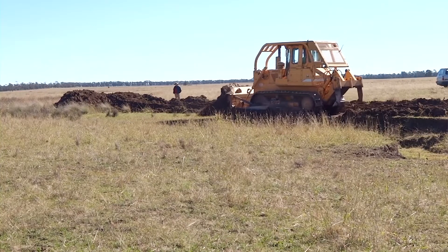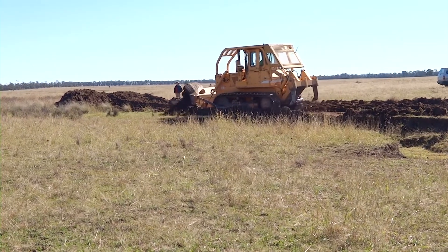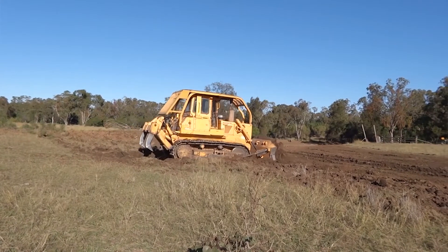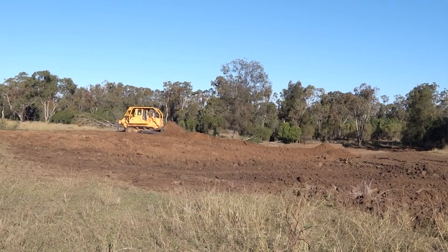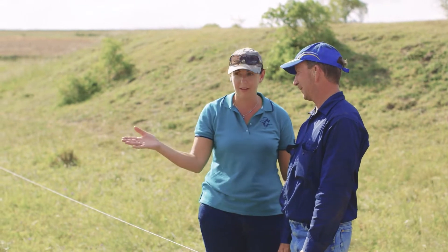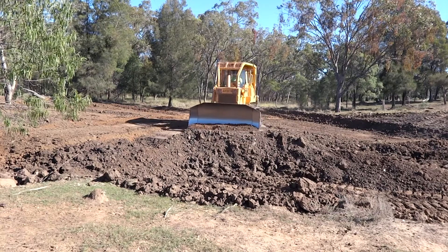The battering technique is where we get a dozer operator to strip off the topsoil from a gully head, then batter the gully head down to make a ramp out of the subsoil. We then bring the topsoil back over that area, which hopefully makes the restoration process a lot quicker. It's effective because we use the material on site and most landholders think it's a reasonably simple, cost-effective method.